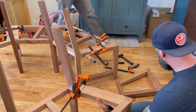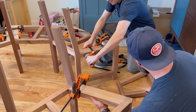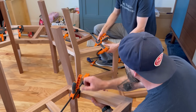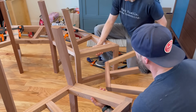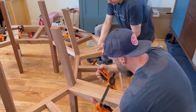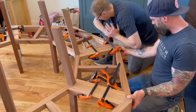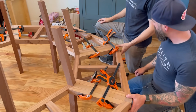So with 7 of our 8 sides done, we took measurements on our last piece and we handmade everything, but we custom fit our last frame piece to size. We were only off an 1/8 of an inch, which isn't bad considering that means we were only off about a 1/64 of an inch on each section up to that point. Not too bad in my book. So we made our last piece an 1/8 of an inch bigger, and it slid in absolutely perfectly.